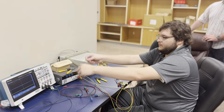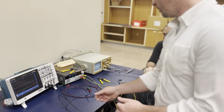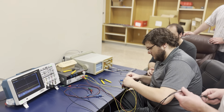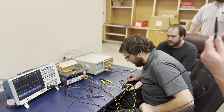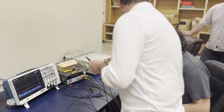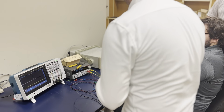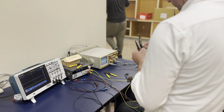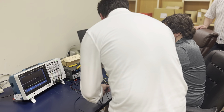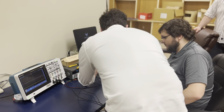What tweaking is necessary on the pots? That's what we're wondering — what do they do? We don't really know. So this is where I say I need to see a schematic. It should be near identical to yours. Also, these should have little ground clips on them. You don't have ground clips? No. Each strip has to be grounded.